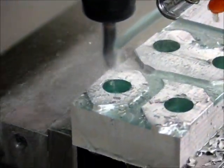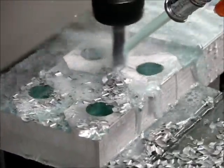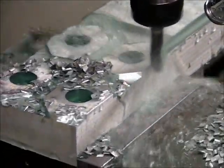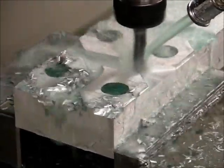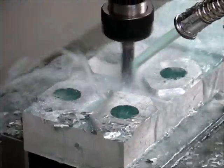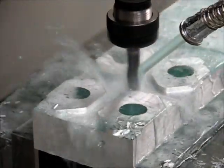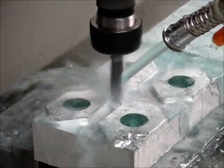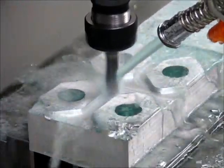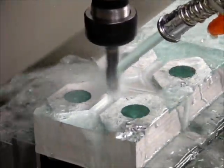Nice to see what full slotting looks like — I really haven't done much of that because I've avoided it with the availability of trochoidal paths in the past. There's some chip buildup there, but it looks like the full slot will handle it. The total depth on this operation is 875 thousandths, taking 125 thousandths at a time — looking at seven total passes. There's a little bit more cutter side engagement each time. Cutter flex will always lead to a little bit of extra tool engagement later.